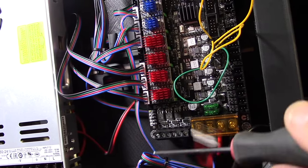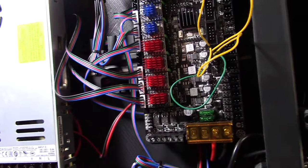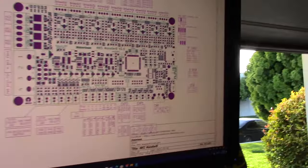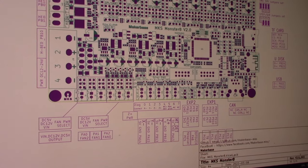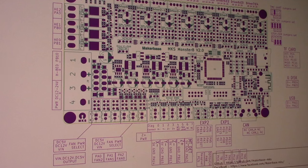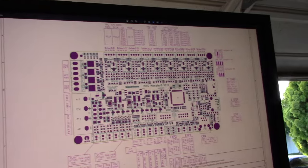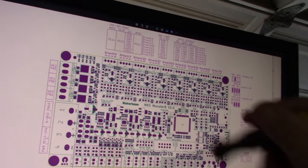Because of that, I can run a lot more power through it — that's how you're able to run a hot end and the heater bed. To change this I need to go into Klipper. The Monster 8 has fewer fan outputs than the Octopus. I'm using PA3 — in the fan selection I'm going to set the pinout to PA3 for fan output, enabling this MOSFET right here.